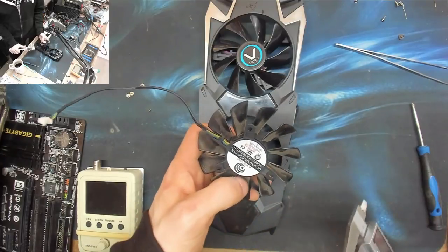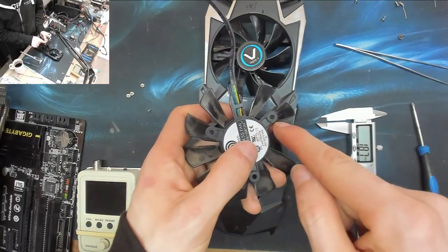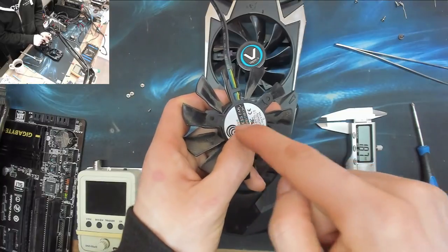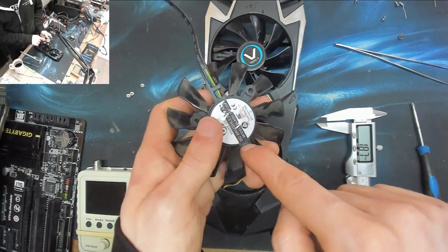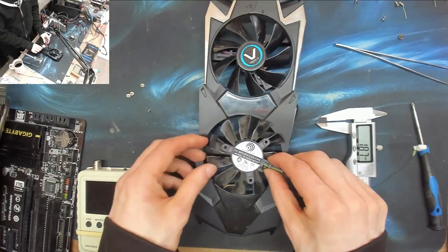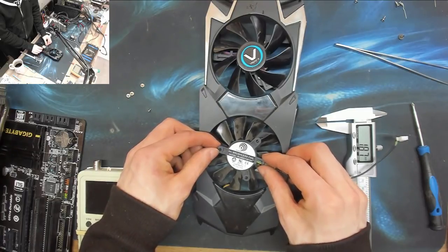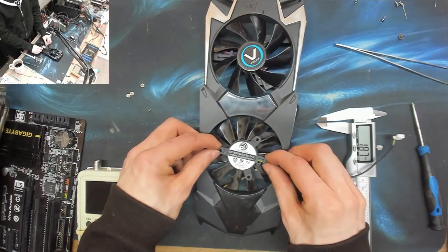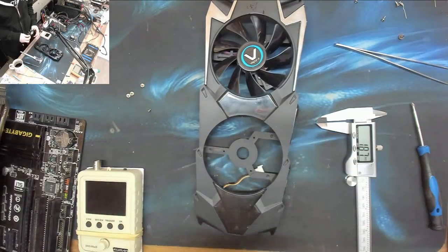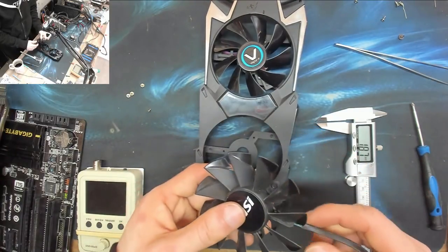So what I'll do is I'll get the Dremel and put a drill bit in it and just go toward the center slightly on each hole and just elongate those holes slightly toward the center, and then it'll fit in and I can center the fan. The fan physically fits in the cowl, by a whisker, but it fits, which is the important thing. So as long as we get the holes lined up, that'll be fine and it shouldn't foul. So yeah, I'm confident that it goes in. We've just got to make sure that those holes line up.